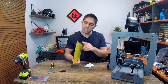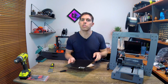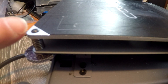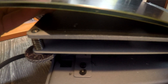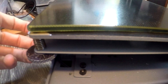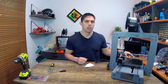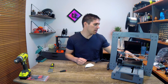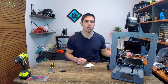This is designed to just peel off the sticker base and put on top of the old one after you've picked off the existing sticker sheet, but we do have a problem. If we look up close, we'll see that the adjustment screws for the top of each corner sit up too high. That means when we try to put our bed into place, it clashes. So unless we want to sit it proud, which means when we try to stick it down it's probably going to crack, we're going to run into trouble. The quick and dirty way is to just rotate everything a couple of degrees to the side and then use clips, but that's not really utilizing the full size of the bed.